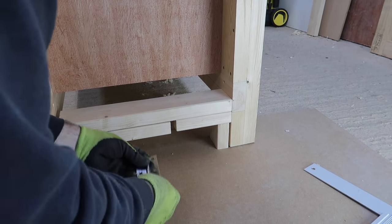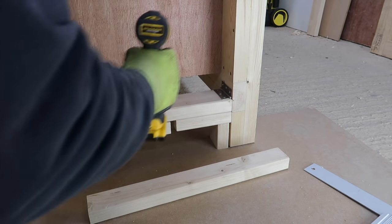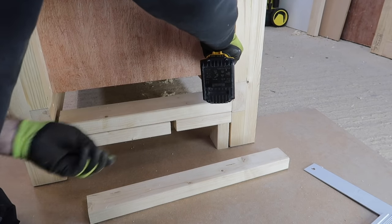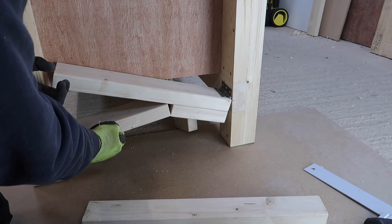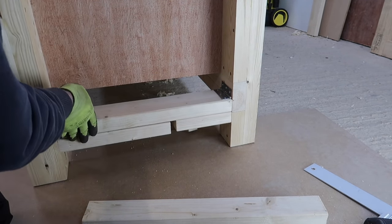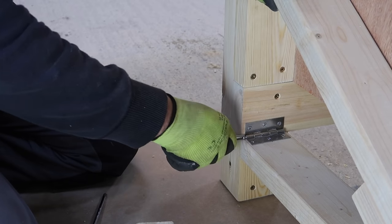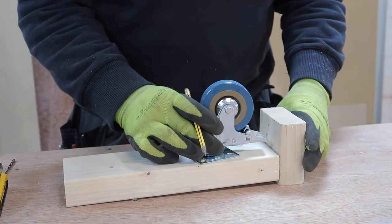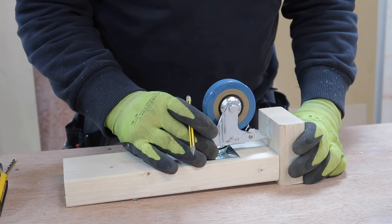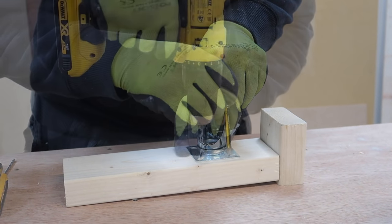I'm lining up the levers with the front edge of the bench legs, which gives me a few millimeters clearance from the ply at the back while still keeping the mechanism in the alcove. You can see while I'm trying the mechanism that the bottom left lever is snagging slightly, so I trimmed off five millimeters once I took it apart, which solved the problem. It's absolutely essential that you use hinges with removable pins on a project like this for assembly and disassembly. The pack of four casters came with two locking mechanisms, which I don't really need, but I do need to make sure they're fixed far enough from the leg so they can swivel 360 degrees without snagging.